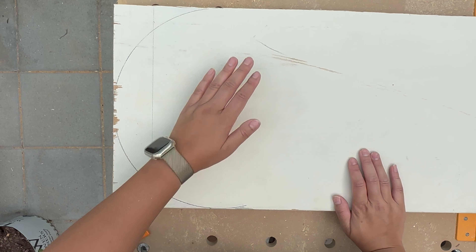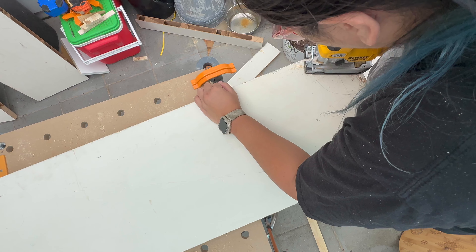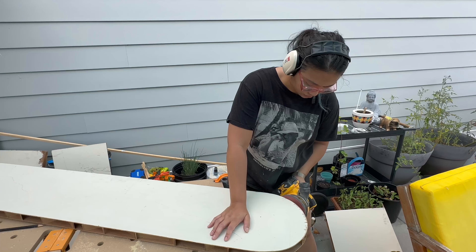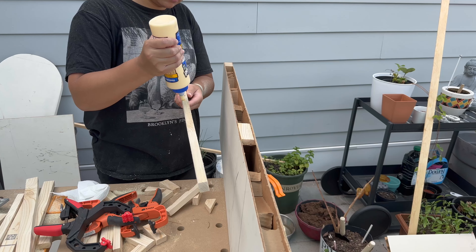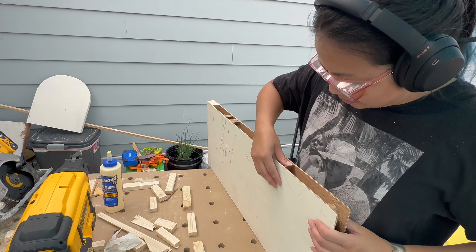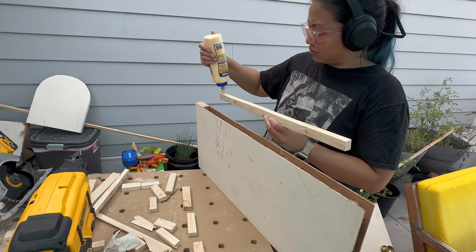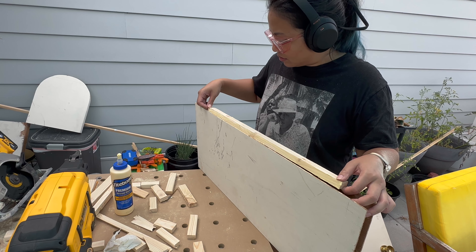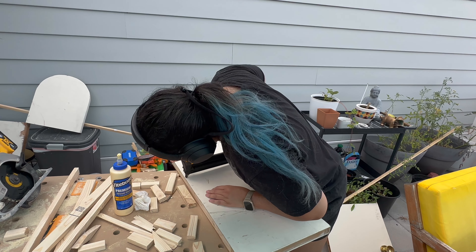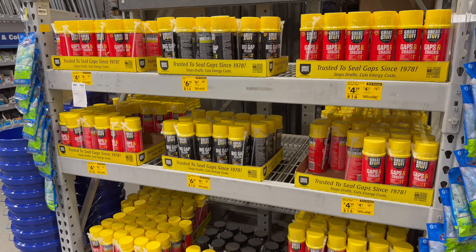Since our door is hollow, I need to add some framing back into the door and find a way to close it up. I punched some of the cardboard and inserted scrap wood to frame the long side of the open ends, and used smaller scrap wood pieces for the curved edge. I used wood glue and my nail gun to put it all in place — if you don't have a nail gun, clamps work just as well. To fill the rest of the gaps, we're going to use joint compound and sand it down. You can also use foam spray to fill the gaps.